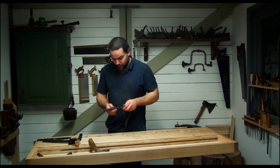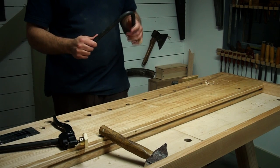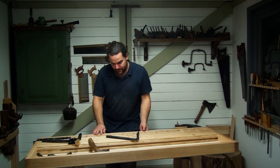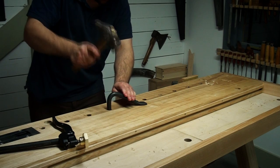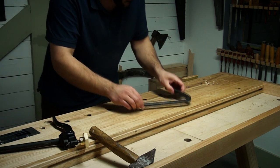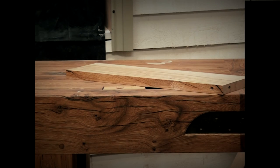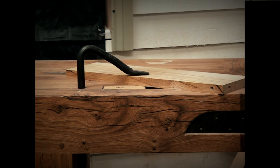Hello and welcome. Just a quick one on how to make your smooth shafted holdfasts grip better, and also on how to make them work in much thicker workbench tops. This bench top is about 3 inches thick and as you can see it doesn't really have much problem gripping at all. But if I was to go much deeper than this it would very quickly lose its ability to grip. To demonstrate this, here's the same holdfast being used in a rather extreme 6 inch thick top. No matter how hard I hit it, the holdfast just can't lock within the hole.